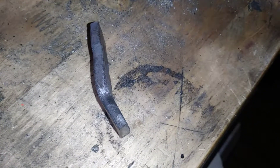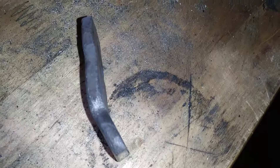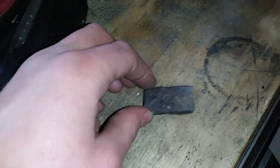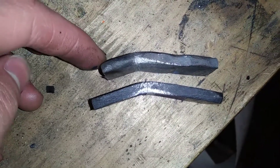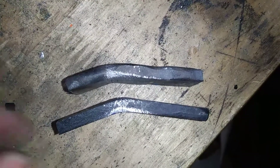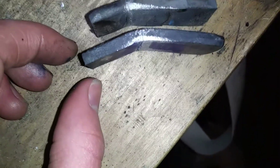Really quickly before I try breaking the oil-hardened one — there's the break right there. These are the two pieces linked together. This is how much it bent before it broke, so it didn't bend a huge amount, meaning it was pretty hard. But it did bend, so it wasn't brittle, which is great. What I've been reading about grade five titanium is that it's supposed to be really tough and durable rather than really hard — that's why it's not great for knives. The oil one bent a lot more and didn't take as many hits, so it was softer and broke faster.